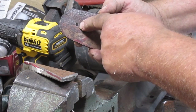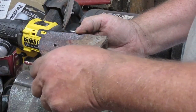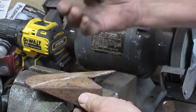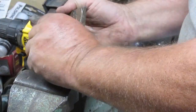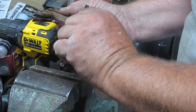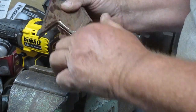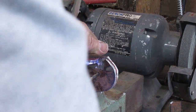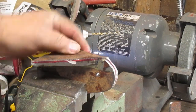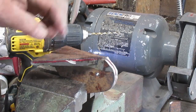Now that I've drilled one hole in the center of where the bolt goes, I have to make sure that I have it drilled in exactly the same spot on every one of these fittings. So here's how I'm going to do it: I'm going to take the mirror image piece — let's call this a right and a left — and I line them up so that these parts that are going against the frame to be welded are identically in the same spot. I clamp it in the vise, double check, tighten it down, then take and drill the pilot. Now I have matching holes. From these two I can do the other two because this left will do the other right and this right will do the other left.